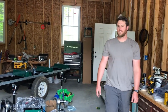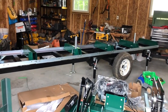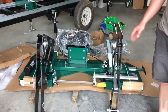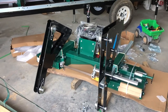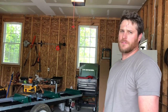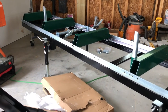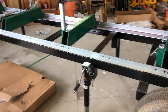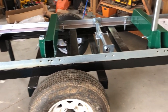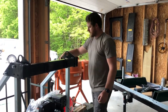Three hours in so far — we've gotten the track put together, everything's good there. I'll tighten down the bolts later. Right now I'm working on the actual sawmill head. This is actually extremely heavy, so once I get this assembled I'll have to have the tractor come in and lift it out. Is it easy to assemble based on the directions in the manual? Yeah, so far it's pretty easy, no issues yet. But we won't see the issues until we go to put the saw head on there — that's when I anticipate leveling issues, and that's why you leave all your bolts loose.